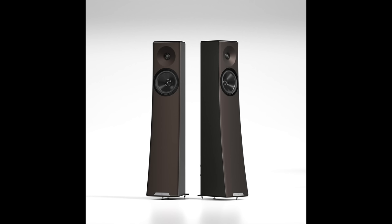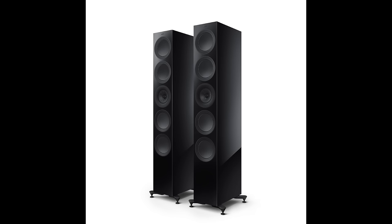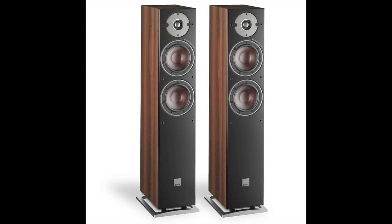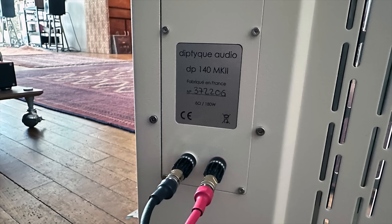We live with box speakers. They're by far the most popular type of speaker. In a box speaker, the drivers are arrayed on the front baffle and they project sound forward. That's the way we hear music at home, for most of us. Now, a dipole speaker projects sound forward and back. So what's coming out of the front of the speaker and the back of the speaker are more or less the same sound. So they energize the room in a completely different way than box speakers do.